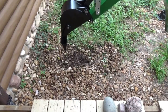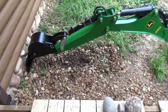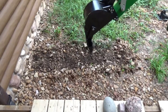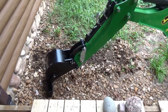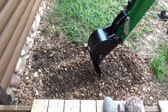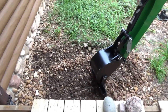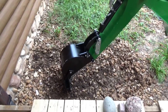Getting a little more comfortable getting closer to the house now. A little more pressure on the boom. All I want to do is pull all that stone out of there. After 11 inches of rain last month, I don't want to go in there with a rear blade and tear all that up, or go in with the front bucket and tear up the yard on the other side of that sidewalk. This is a real nice way to go in and just surgically take that stone out or whatever I want to rake out of there. So far, I'm really happy with the way this is working.